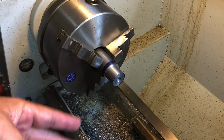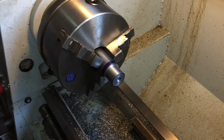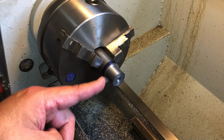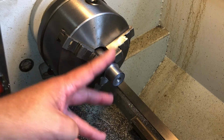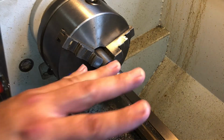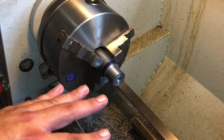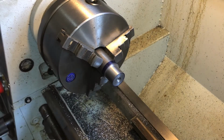So in my career, my 44 rifles I've done now, a young career, I did one rifle barrel where I got to this point right here, then threaded it, and then went and cleaned everything up, and I rolled a thread over. And I heard another student talk about that he rolled a thread over once. That's bad, okay? You roll a thread over, you gotta file it out, and that's a bad day. That sucks. All the hard work you put in to getting your barrel nice and concentric and everything, now you're sitting there with a 6-degree file, filing on it so you can get your receiver on there, okay?